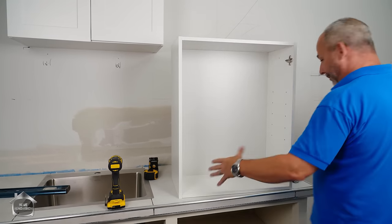Beautiful. The next kind of patch is if you've got a plug. These things are a pain in the butt. You can push them all the way through, or you can get a hammer and rip them out, or you can just go like this with your knife and chop the head off. Take the heel of a 4-inch knife with a metal heel and make a bit of a dent. It's easier to fill a hole than to create a bump when you're patching over something, okay? See that? Those holes are filled. You might need to do two coats because this stuff does shrink when it dries.